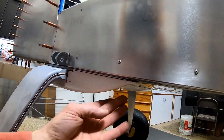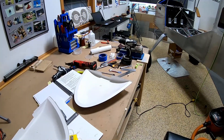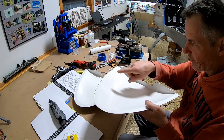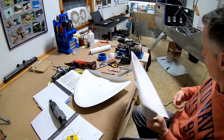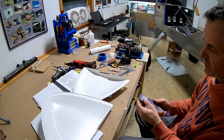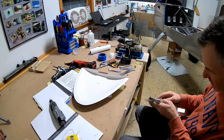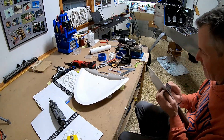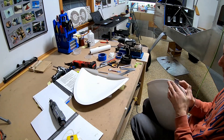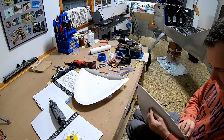So far pretty happy for the first cut — going to smooth that out and do a little more trimming. My quest for getting this perfect edge: the little pen trick with the tube worked great for marking, then a lot of sanding with the grinder getting it close. For the final finish I put a piece of about sixteenth-inch acrylic double-sided tape onto my little sanding stick and kind of run it along there — you can feel the high spots. Looks like it comes out pretty damn good. You have a consistent gap all the way around.